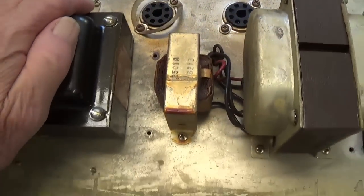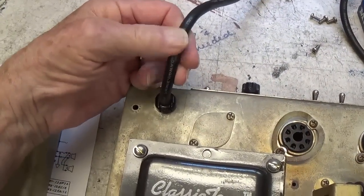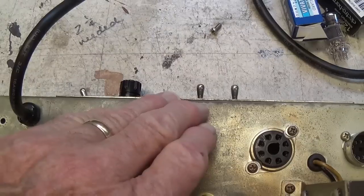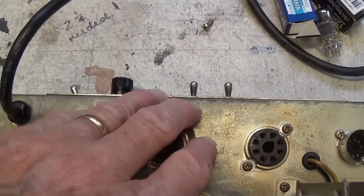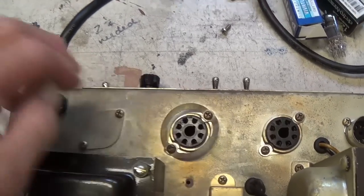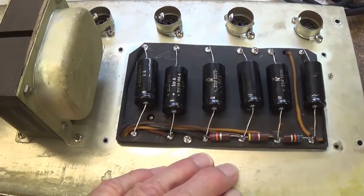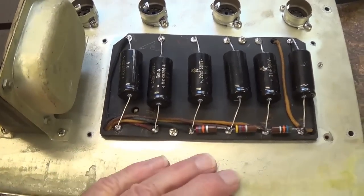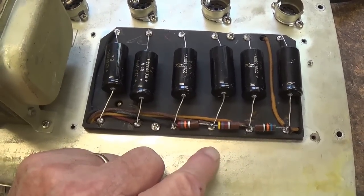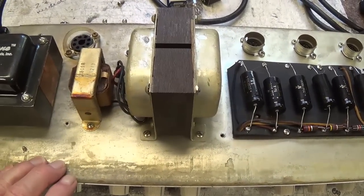The other things that he mentioned were that he thought that the primary cord had probably been wired incorrectly. And from what I've seen, he's right. Also, he wants the negative feedback loop installed in lieu of the polarity switch, which is useless with a three-wire power cord. And of course, a thorough review of all the components in the amplifier circuit to make sure they're within spec and functioning properly, replacing those that aren't. So with that in mind, I think it's time for us to get started.